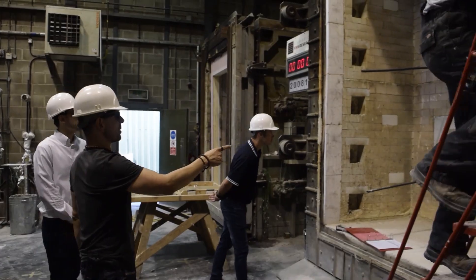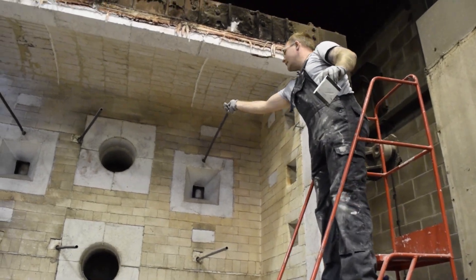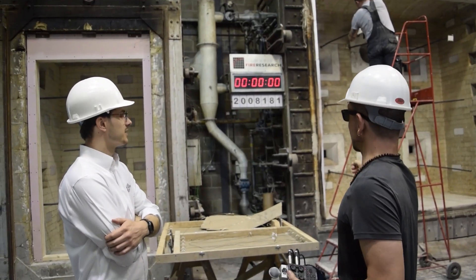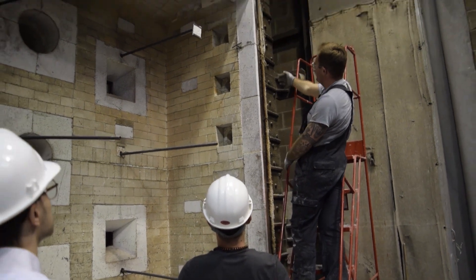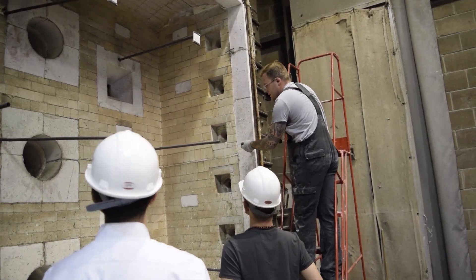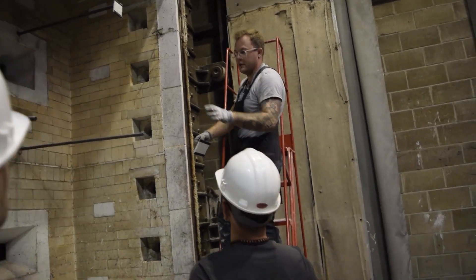And this is where the fire is coming from. You could cook a giant pizza in this. What temperatures do we get? 1200 degrees. How does this thing get hot? We pump gas in from the tank — we use propane. It comes through our gas system and out these 12 holes. We can adjust the air and the gas mixture. These are called dampers — they open to let some of the heat and the pressure out so that you control it on a controlled curve.